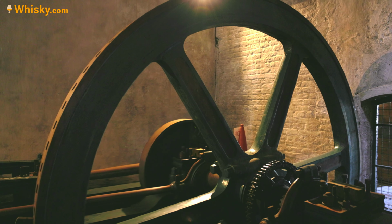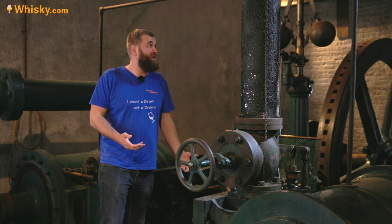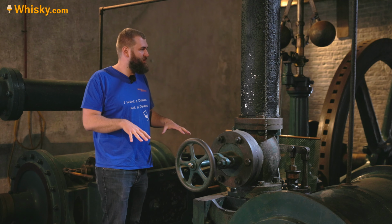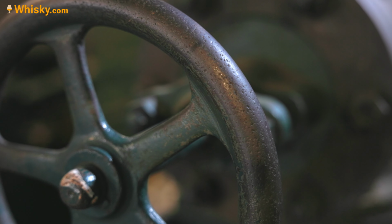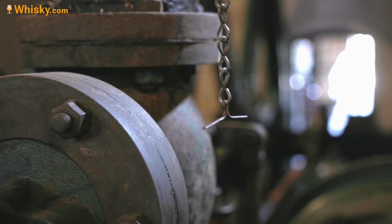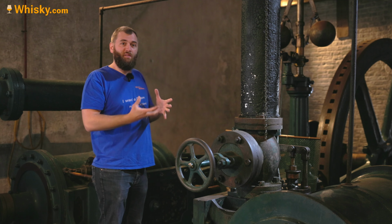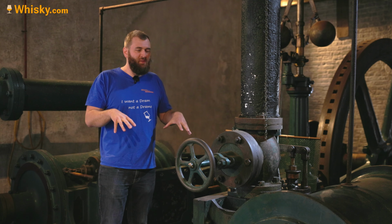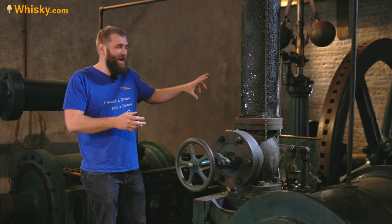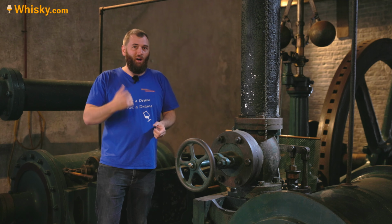They actually didn't run the steam engine that often, as the water wheel really gives you free energy and the steam engine just needs coal for it. The steam engine has 150 horsepower and the water wheel has 160 horsepower. So when they ran on steam, they ran it a bit slower. And obviously, before the steam engine, you need pressured steam. Afterwards, you could use the steam for the brewing tank, and you could use the steam engine to heat the brewing tank, as they were pretty sophisticated for having hot water for their mash tun and not having to heat it some other way. And so this was kind of their backup engine, just for the mechanical part of the energy. And now let's have a look at how the distillery obviously needs heating energy, so how they did that.